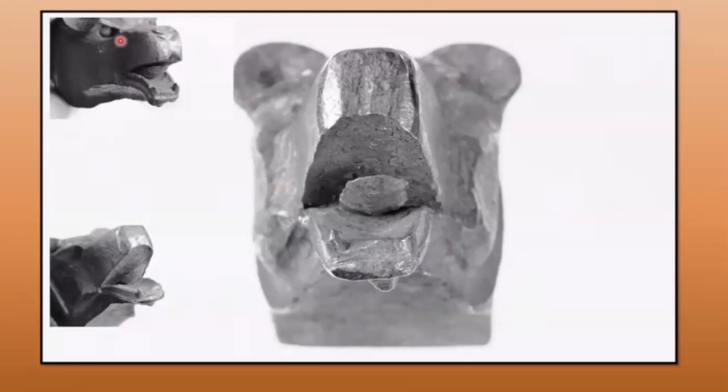So again, this is what we're after with our bear's head. We want enough of the teeth material to get two incisors, some molars at the back. And so I'm going to start in the center, push the material out, and then I'm going to gather it with another one of our fullering swages. Let's have a look at that.